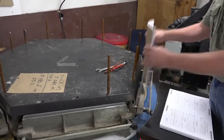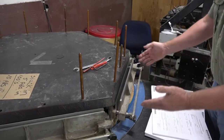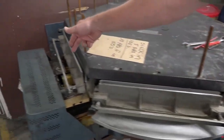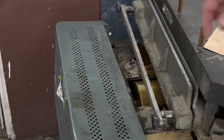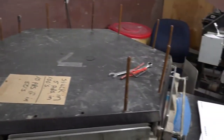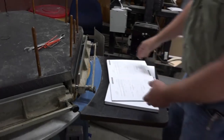We're going to insert the pad in here on the pad edge at the bottom. The clamp, when it moves around here, is on a cam and it's going to come in and clamp it and hold it tight. Then it's going to come over this glue drum and put a layer of glue onto the bottom of the pad. As it goes around you can keep feeding each one of these stations, and as it comes around the clamp will open up and it'll discharge over there, come out on a conveyor ready to stack and go to a cutter or the next process.